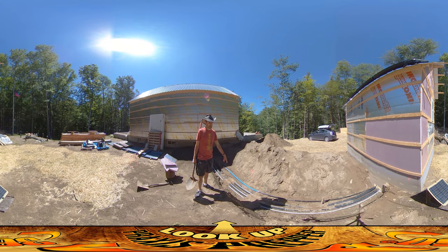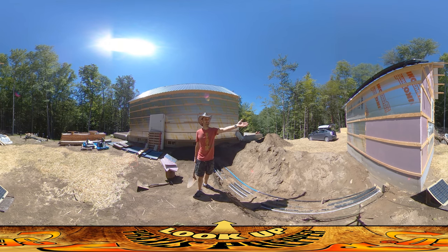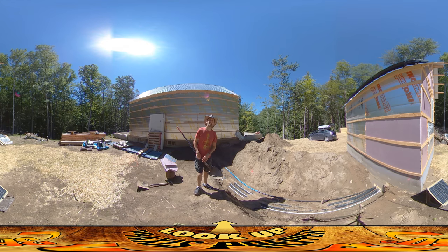This water line is only going to be maybe two feet max under the ground. You really want to have it in this area about four feet down, so this is the kind of thing that would just be for summer use. I wanted to run a water line to the shed so I could send water over to my parents if they have a trailer over there — so it's a summer use thing and we'll just blow the water line out in the winter.